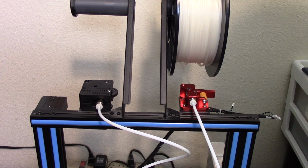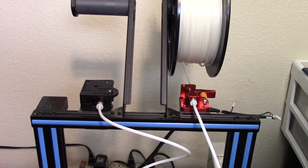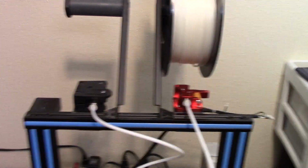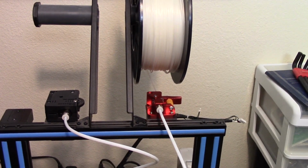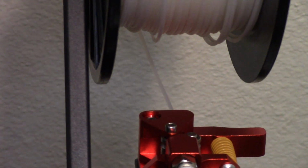Everything is still heated. And we're going to come to prepare. And that's not right. Move axis. And move the extruder. And move 10 millimeters. And we're going to dial 100 millimeters into it. 90, 100. So 100 millimeters. Let me zoom you in so you can see the mark coming, and we'll see how close we got this time. This time's going to be the charm. I know it is.